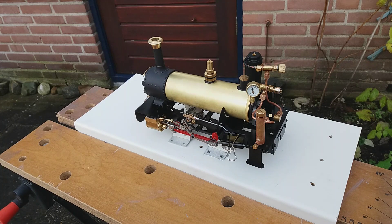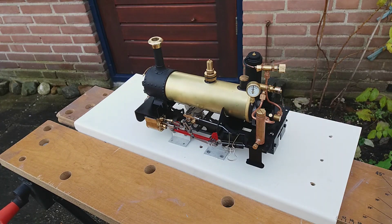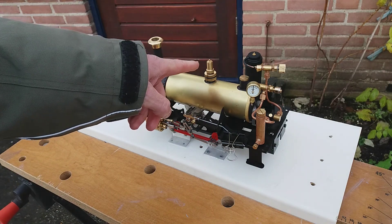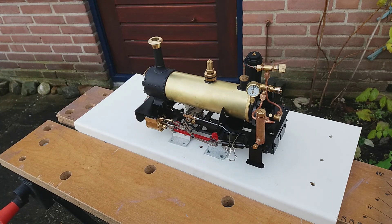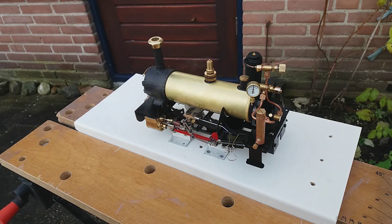The Roundhouse safety valve — standard — normally starts to lift a little bit before 40, around about 35 or so. Nearly at 40... it's 40. And the safety valve — it's just starting to weep now. There it goes, just starting to weep. Now it's lifting. It's indicated just about 40. Okay, we'll turn the gas down.